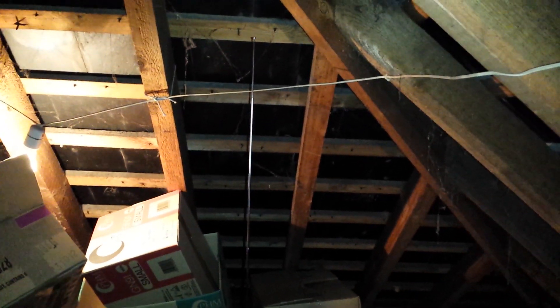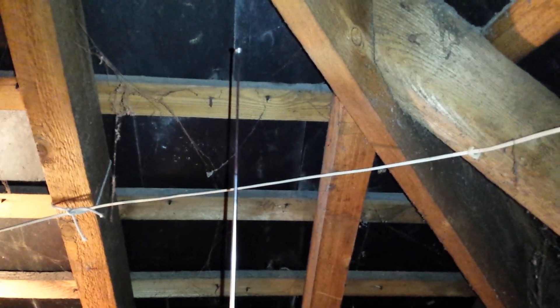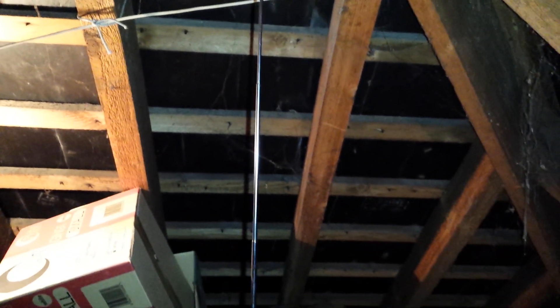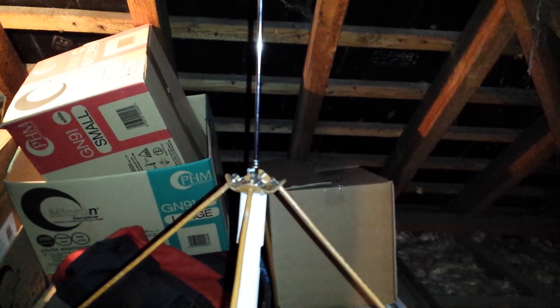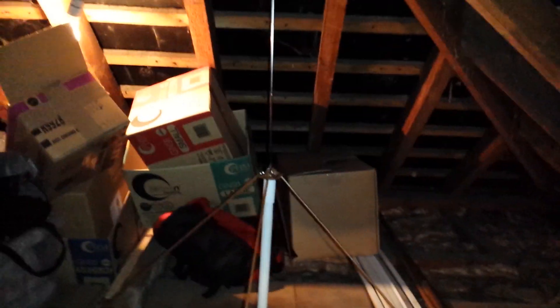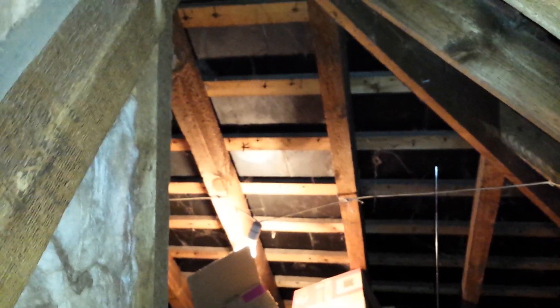There's one very good reason for that - I suffer horrendous pager noise on any radio I've ever had here. So I've decided to downscale the antenna from a big white stick collinear outside to a quarter wave ground plane in the loft. Part of the reason for choosing a quarter wave over, say, a dipole is the lack of space I actually have in this loft.